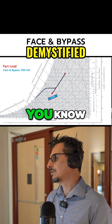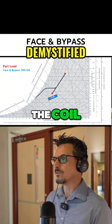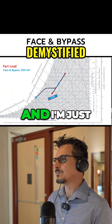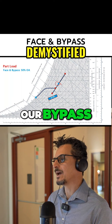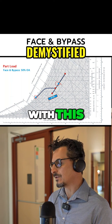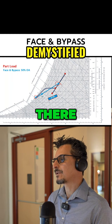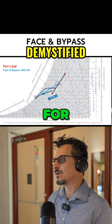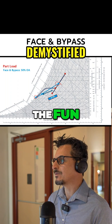So where you might fail on this scenario is if you had a lot of outdoor air. You're bypassing air around the coil, so if you had like 50% outdoor air, you can get into a little bit of danger here. Now your bypass air is up here because it's 50% OA, and it's mixing with this leaving coil temperature here. It would fall along this line, which is represented there — a few degrees of heat. I'm going through this kind of quickly because I have a few more slides and I want to leave time for questions, but please come back and watch this and apply your psychrometric chart.